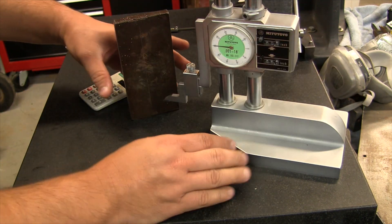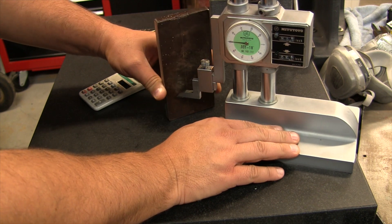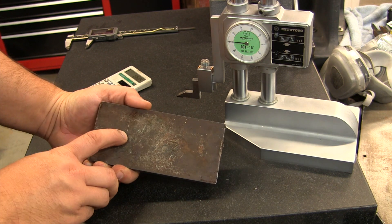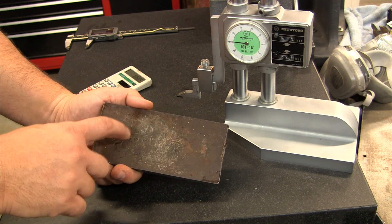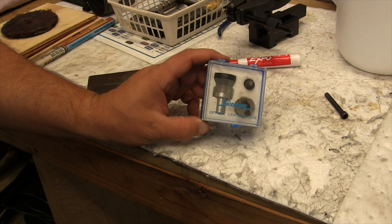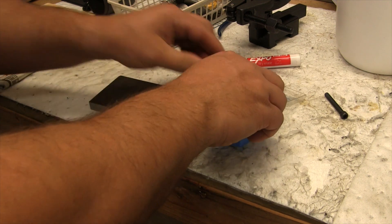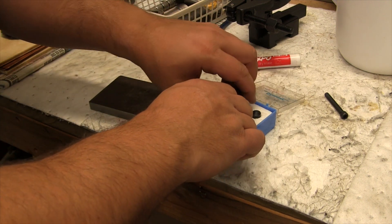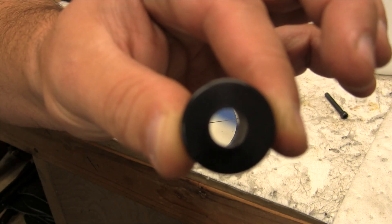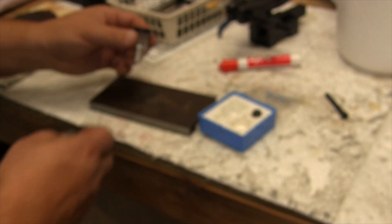There's a quarter-inch buffer — it's really not all that critical. We'll center punch that and we'll start drilling some holes and then we'll bore it out. I always enjoy a chance to use my optical center punch. This is a Skidmore optical center punch — I just like the concept of these, they're pretty neat. There's a crosshair in there.